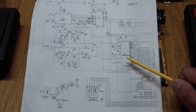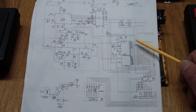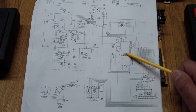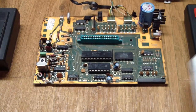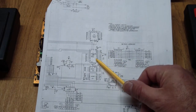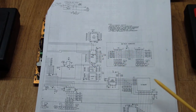This particular one had a built-in mask ROM. If you could fit all your code on the mask ROM, you then had pretty much 24 general-purpose IO pins. The way it works is it has some helper functions in the mask ROM, but it accesses external ROM — in our case the cartridge — which sits on the address and data bus. That's why it comes up with garbage when nothing is plugged in: even though the built-in ROM has rudimentary handlers for the startup vectors, they all point into the cartridge address space, and if there is no cartridge, not a whole lot happens.